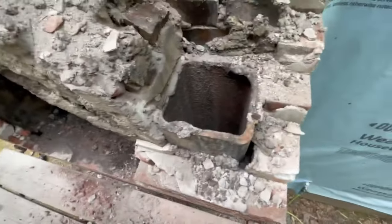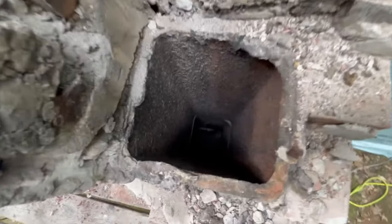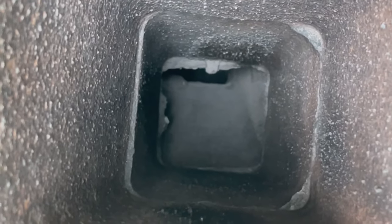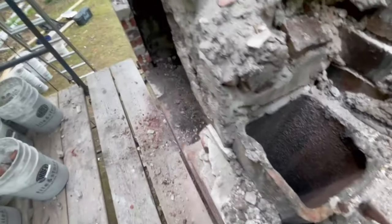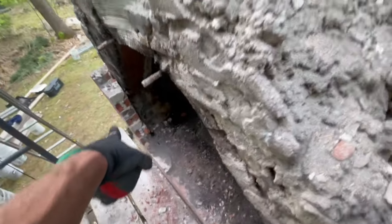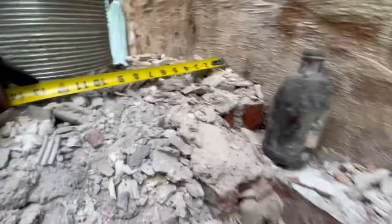This is your flue coming up for your boiler — you can see it's all mortared in real tight. When you look down, you've got mortar hanging off all over; it's not the smoothest thing. Obviously it works, but you really want to try to do a little better than that. Basically the smoke chamber is four inches thick on the side and on the back they did get it eight inches thick.